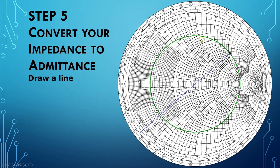Finally, we want to convert this into the admittance realm. And the reason why we do that is because this is a parallel stub match. And it's a whole lot easier to work in admittances than it is to work in impedances when you're dealing with parallel stub matches or impedances in parallel. So to do this, we simply draw a line starting at our impedance through the center of the Smith chart, past the SWR circle, all the way to the other side over here. And then we're going to place a dot where that line crosses our SWR circle. This is the admittance value for this impedance.